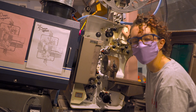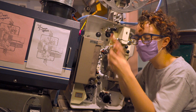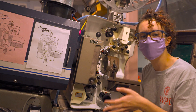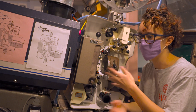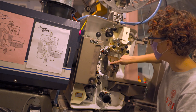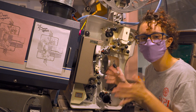One important thing to note with 70 millimeter film is that it is very easy to destroy, so you have to make sure you're paying close attention while it's running because it's very easy for the film to get cut down the middle. Also, the shoes don't snap into place — they will just drop right down, which you want to keep in mind while threading so you don't destroy any sprocket holes. This will help ensure that the film stays in good quality and doesn't get shredded. We also have different lenses and different dowser plates for the 70 millimeter projector — ours has a guide telling you to turn up with the 35 millimeter lens and turn down with the 70. Other than that, and the fact that it is twice as wide, it's very similar to the 35.